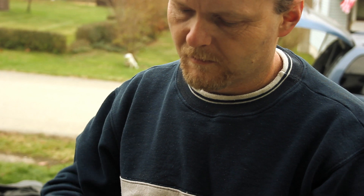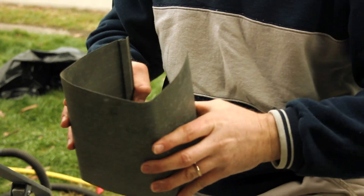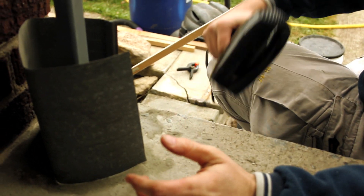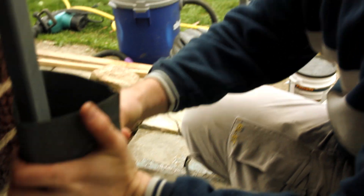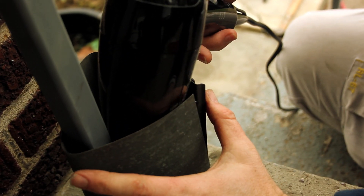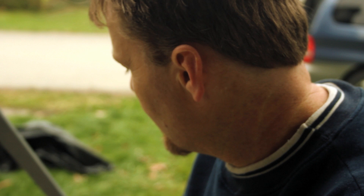Because it's a little chilly today — about forty degrees or maybe a little less — I have a little piece of metal here from an old piece of ductwork. I'm putting it around the post and closing it a little bit, then I'm putting a hair dryer up at the top. I'm going to run that for about fifteen minutes to really get it to set up well before we take all the clamps off.